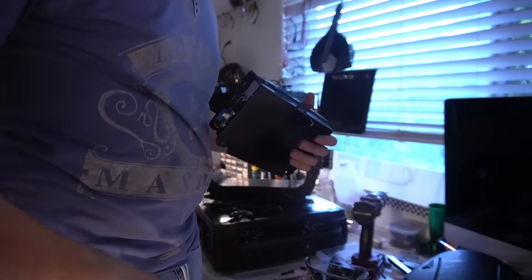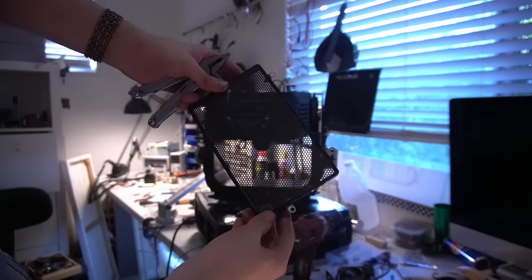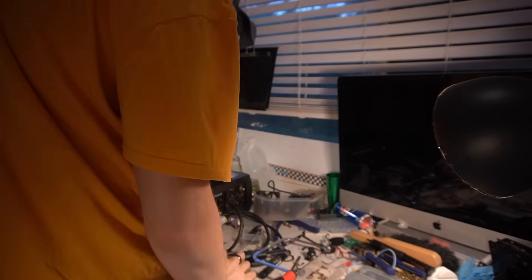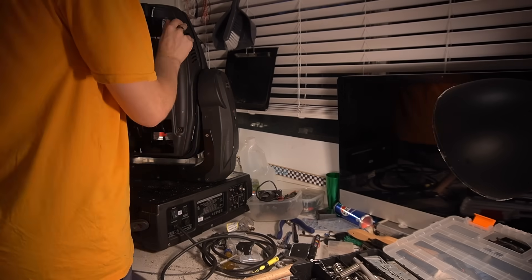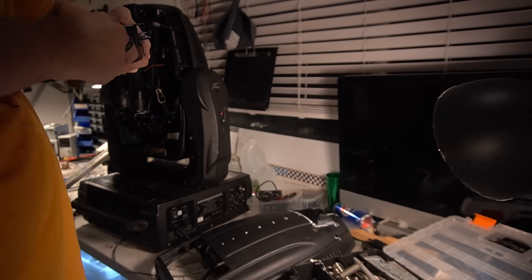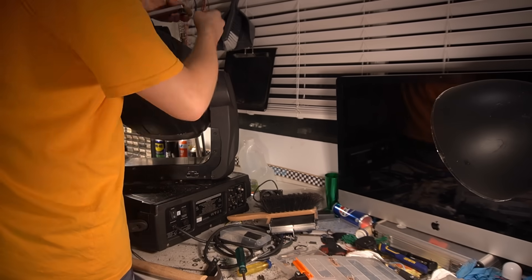After that, it was time to focus on the missing grill. After some unscrewing, some banging, some more unscrewing, some slicing, and some more banging, it came apart. I made a frame for it and mounted it back in the case with some Meccano L-brackets. After that was done, I had to work on the front shell, which was a bit more complex. I had to cut out specific holes and shapes into the shell as the top of the camera did not fit inside. I made another grill fit — this time easier as the mounting points were all still there. I just had to remove some heat fins to fit the power supply. I put the seals back on and held the top of the shell in with some springs around the metal bumpers as the original screw points were no longer there. And that's the light done.